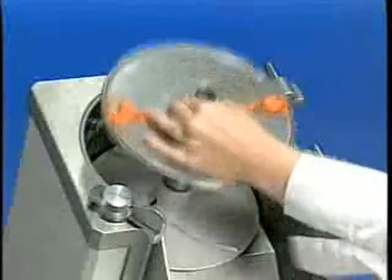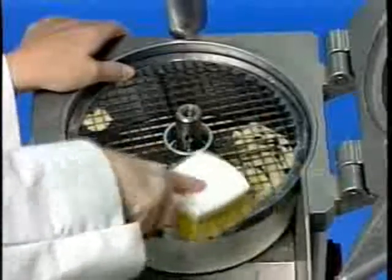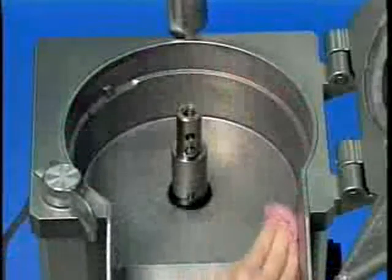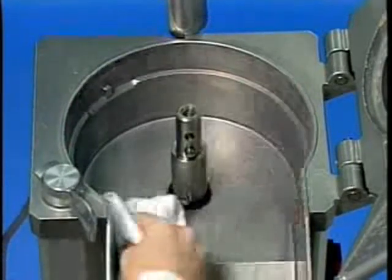Remove the cutting tool. If you have used a dicing grid before removing, push the remaining leftovers through the top of the dicing grid with a nylon brush. Pushing leftovers through the underside of the dicing grid may damage the grid. Remove the dicing grid and ejector plate. Rinse in lukewarm water. Wipe the knife chamber with a clean, damp cloth. Wipe dry with a clean, dry cloth.